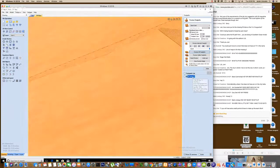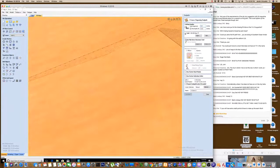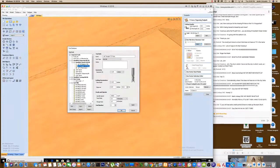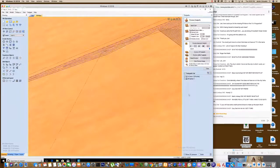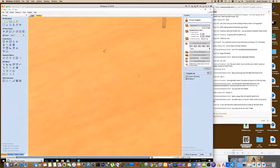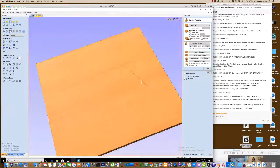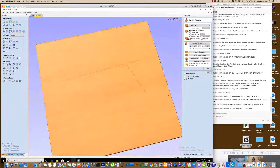And for something like that, for those of you that V-carve, you know the best thing you could do is use a flat area clearance tool. If you're using your V-bit to carve out every bit of this area, that's just an incredible waste of time. Select whichever end mill you want. Calculate, and you'll have to swap bits, but in the end, it'll be a nice, clean, flat cut. You won't be using the tip of a V-bit at minuscule increments, and it'll take forever to clean it out.